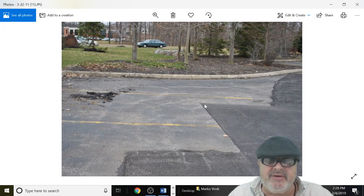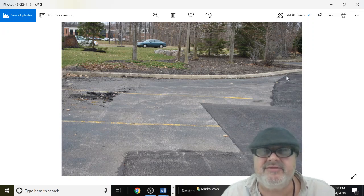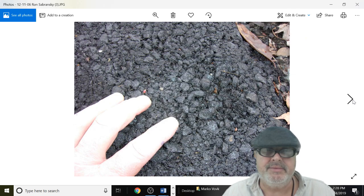Now this might work here. They cut this and then they embedded it. So sometimes this works. This is the one guy that used a saw. You've got to cut this with a saw, then make it level and put an expansion control joint in there. This guy, that ain't going to work. That's going to fall apart. Here's an example of a couple different contractors. See, it's cut, and they would caulk the edge of it. That might work, because you have a control joint.